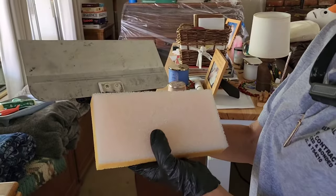Okay, guys, that's her second coat. She scraped out that bad patch job that was underneath it. It looks like somebody's already been in that panel, the electrical box. Yeah, and they did like a really lousy patch. Hers is doing really good. It's nice and level. She took a 12-inch. I missed half of it because I'm working with Vinny over here. But she took her 12-inch trowel and skim coated it with the 12-inch after she mudded it in with the smaller one. Now, guys, when I say she don't sand, she don't dry sand.